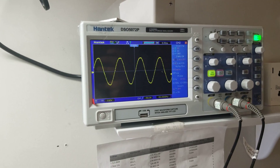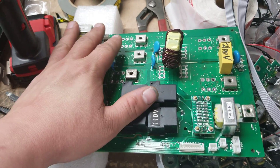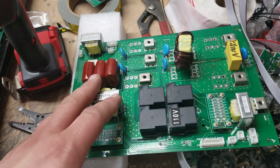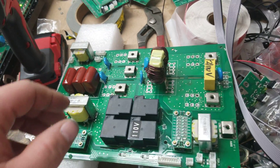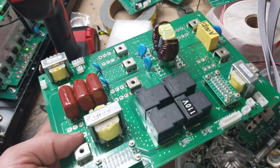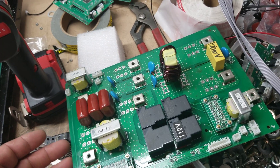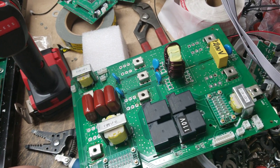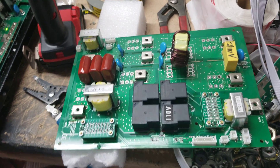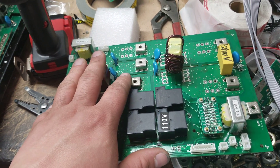That's why you're seeing this perfect sine wave here, and I'll show you what I did. Here is a charger board — this is an older charger board; the new ones have the large relays on top. This is an older charger board identical to the one in this unit right now. You can see these red caps here — these actually help filter noise out of the signal coming from the transformer. These are for the input side. You'll notice that the output side actually doesn't have any filtering whatsoever. So if you have a bad transformer, L1 will generate an enormous amount of noise.